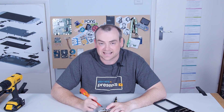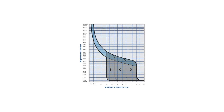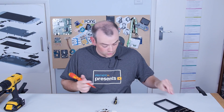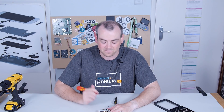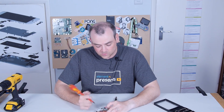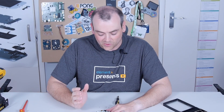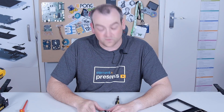The tripping characteristic on a graph is actually an interesting double shape, and you can work out the disconnect time based on the fault current — you're talking milliseconds normally, depending on the fault type. The magnetic is quicker at tripping at high currents; the thermal is better at tripping at low currents. Depending on which mechanism activates depends on how long it's going to take. All this is going to do is switch the live conductor or phase conductor depending on overcurrent conditions.